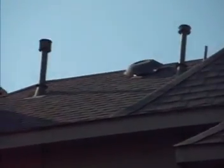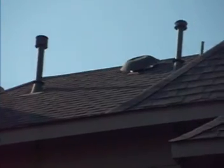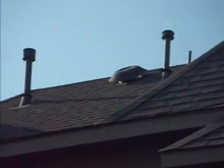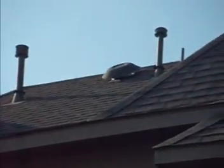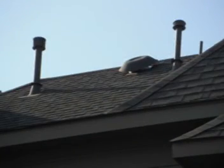The two flues in the video image here are too close to the vent. The vents need to be extended up to clear the roof and prevent gases getting back down into that roof vent. We have a damaged gutter here.